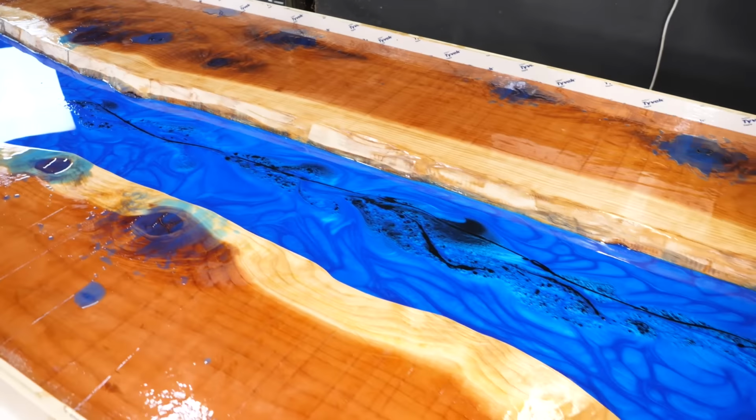You're going to know you're done with your seal coats when you come back the next day and it's perfectly smooth. When you come back and you have craters, big old dome bubbles, that's off-gassing. That's what you're seeing right here. We're going to sand that cratered surface back down flat. We're going to sand any bubble open and apply another thin 1 ounce per square foot. When you come back and it looks nice and glossy, you're ready for the flood coat, which is what I am applying right now. I went ahead and applied 3 seal coats already.